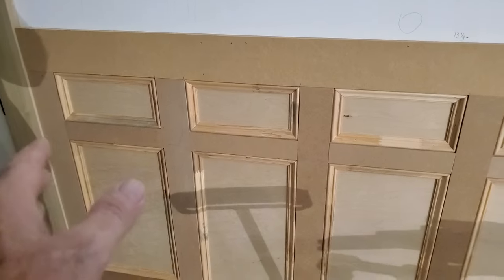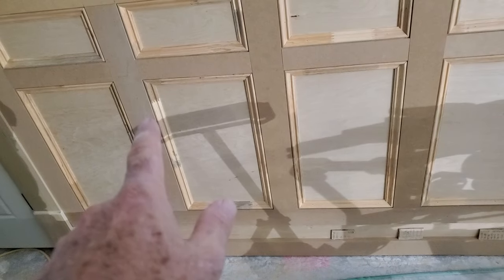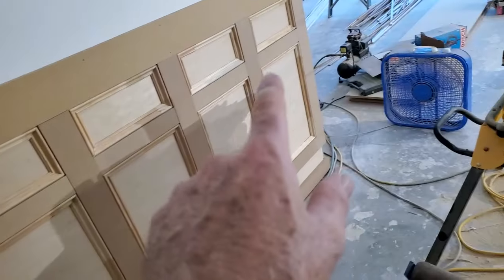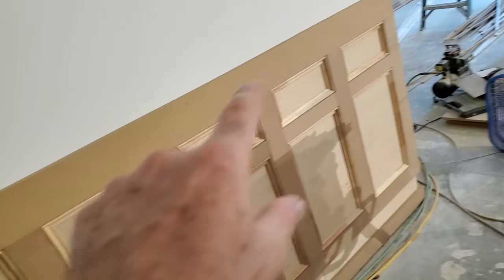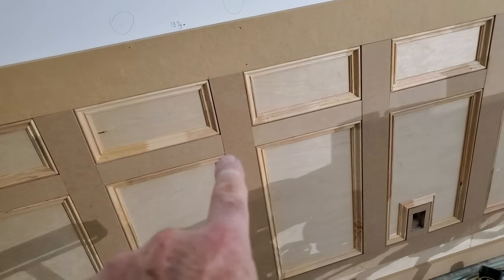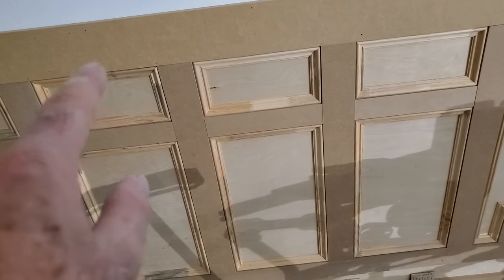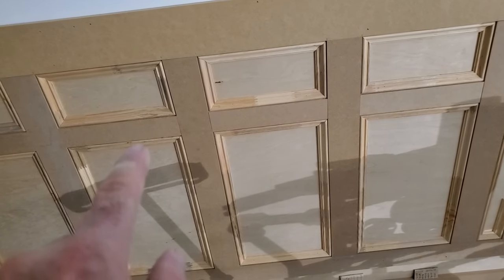So I go on a measuring spree. First I put the plywood, of course, and then I put these. And then I cut these, and I'll put one here and one down there, and then I'll set this on top. It just holds it with a couple of nails on each end, and then I fill these in between. They're all cut the same length, right? And after I put these in, I measure all these pieces. So I take a measurement here, here, here. These measurements are usually the same. And then a measurement down here, and I make a little cut list.